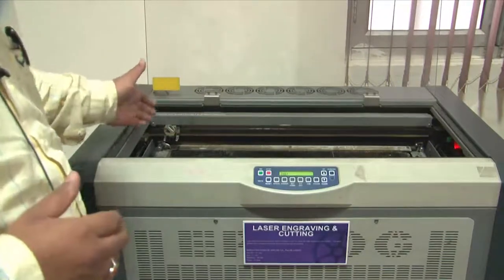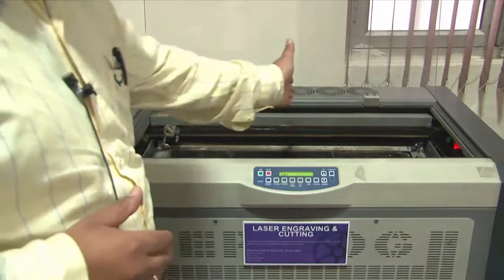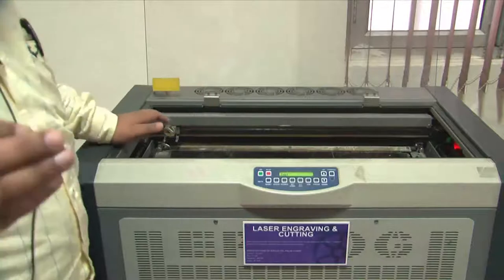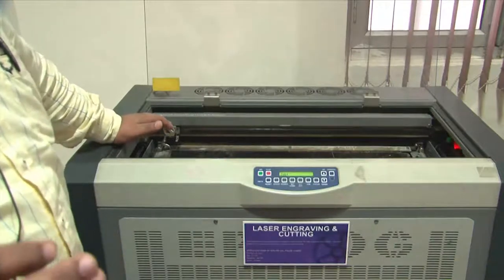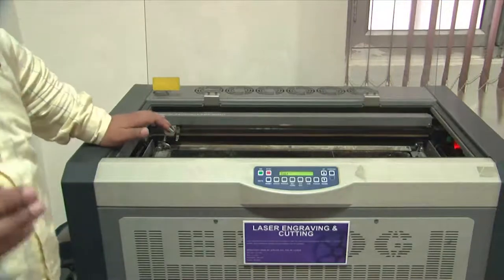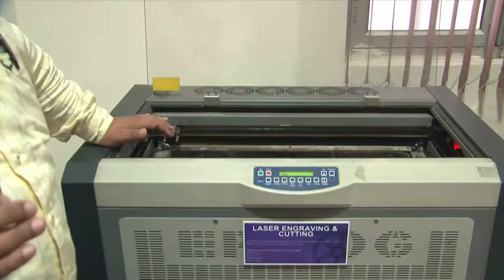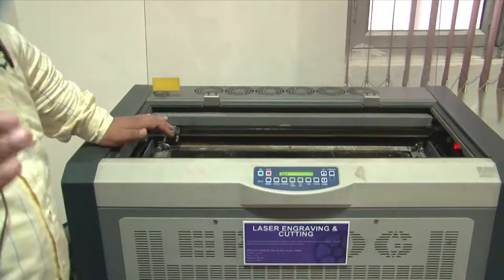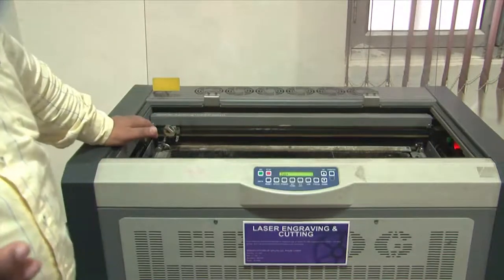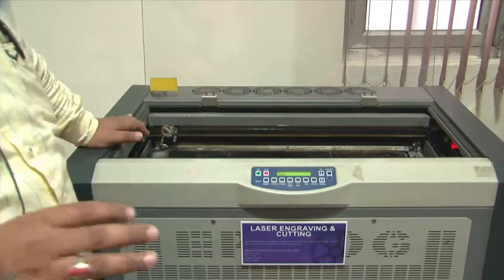So if I were to divide this surface by scanning it into lines of different types and natures, the minimum spacing between two such lines is about 50 microns, and this really defines the way that the laser is used for cutting on soft and hard polymeric materials. So we are really limited to a resolution of about 50 microns, and therefore anything above 50 microns can be etched and formulated using this particular machine.